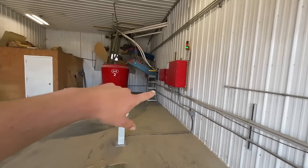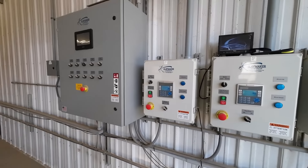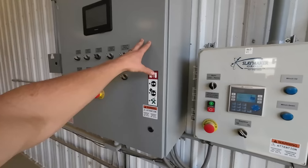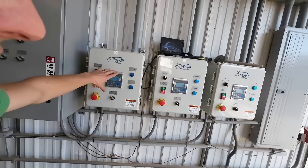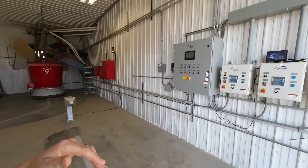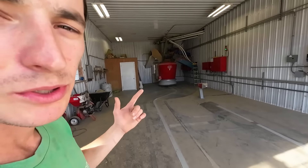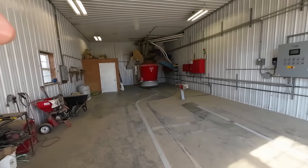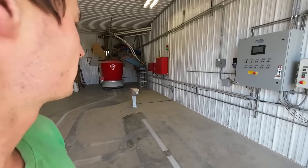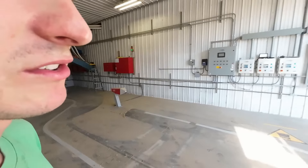The Vector system's main brain is in this red box. All of this equipment right here is built by a local company and controls all the silo unloaders and the conveyors. This will get a signal from the main Lely box to start the shutdown process, then eventually turn the conveyor off. We will be able to get mixed accuracy data — that's not coming through on the computer yet, but it's going to be really interesting to see what the percent accuracy is on these ingredients. We're hoping to be well above 90% accuracy on the forages, and the grain ingredients should be even better.